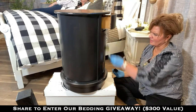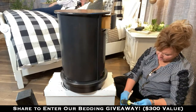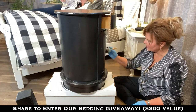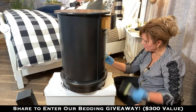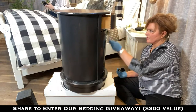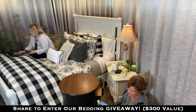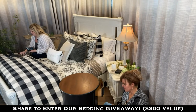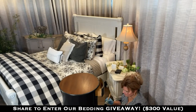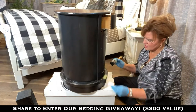You see us do everything — brush roll, brush roll, brush stipple — just use the little applicator. That helps, or using the roller keeps you from having to do all the pouncing. This roller is doing the same thing the true applicator does. On round surfaces and spindles, doing chairs, the true applicator is fabulous — it lets you go around contours like on a bed or where you've got posts. The true applicator lets you turn that corner without having to go around and round with a brush.